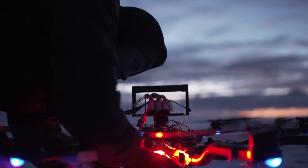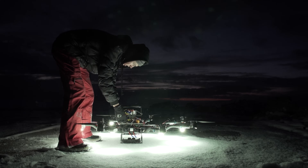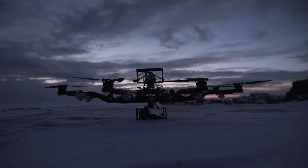This saves weight because it eliminates the need for large heatsinks or cooling fans. The lights run off three 5 amp hour 3-cell packs in series. Each LED chip has a glass lens that throws a 60 degree beam.